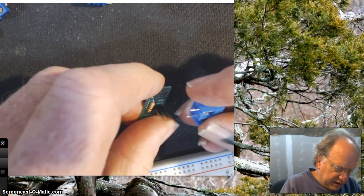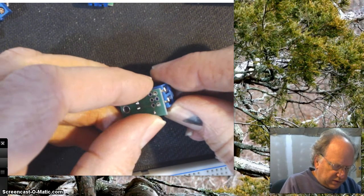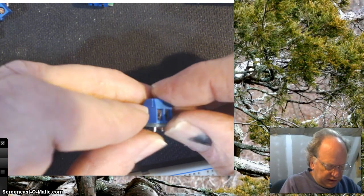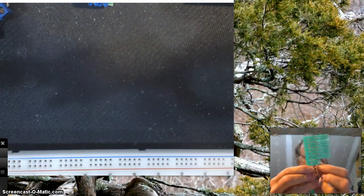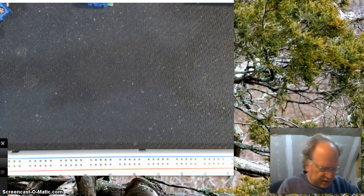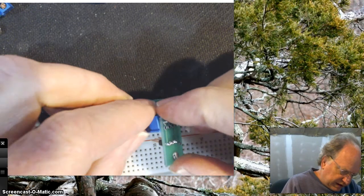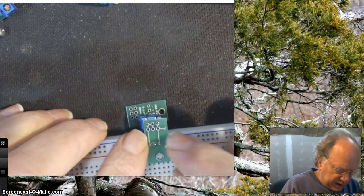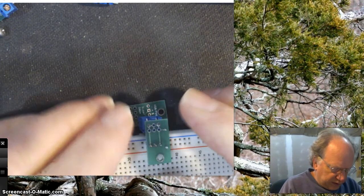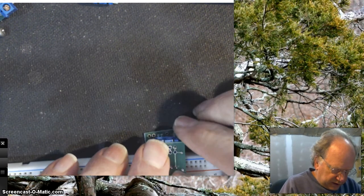And sometimes you can put it on the further back, but usually it crashes into the resistor in that case. So if you put it then into these 2 holes here, okay, the ones on the outer edge, you're going to have your best fit, more than likely. I like to use another board. Actually, if I didn't show you this, I should say that if you need additional boards, usually there's going to be a block of these sitting around. You can just snap them off. They're kind of etched on one side. I'm going to use another board. It doesn't have to be one of these boards, just any board, because it turns out that if I put this guy right on the last row, and insert it, and set it on top of another board, it's just about perfect. All right, it holds it up. If I don't have that board down, it falls out. But this board underneath it lifts it up just enough that you can kind of get it held into place.